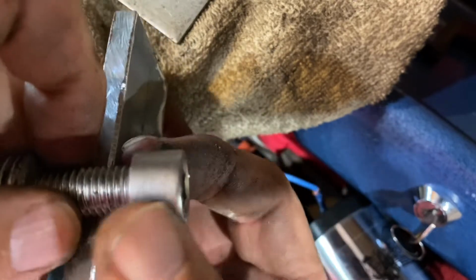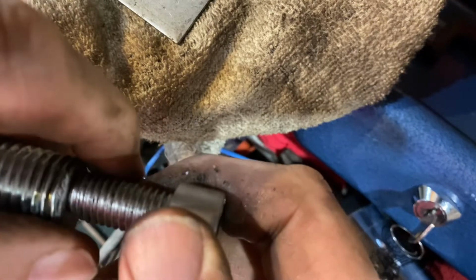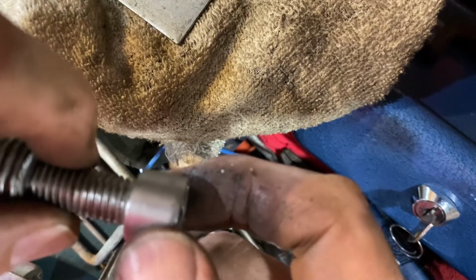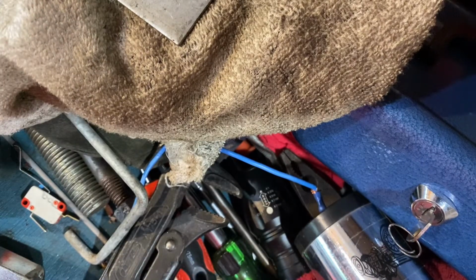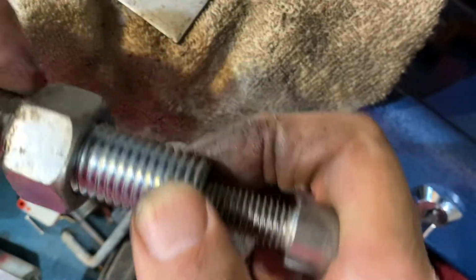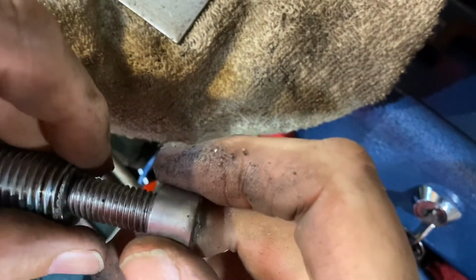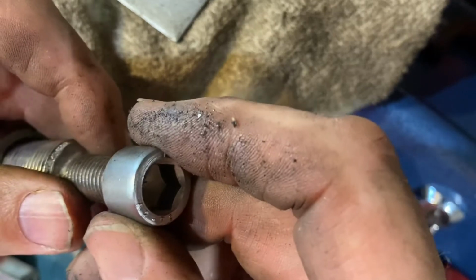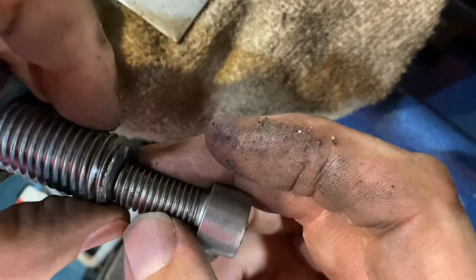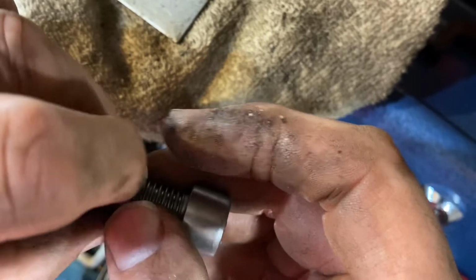And if I make the hole slightly bigger, I'll allow myself a bit of wiggle room, because remember, this will be connected. We're going down through a shaft. And the trouble, we learned that lesson before, going down through a shaft, if you're not spot on, you've got any wiggle room, it'll just rub itself against the side and jam, won't it? What to do? Actually, what I'll do is I'll put a nut on the end of there and hold it all together like that, and then weld the nut, and then weld this on the nut. Yeah, so that'll be well and truly secured.